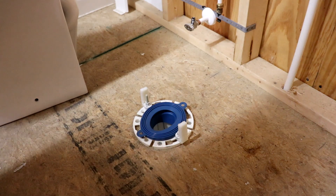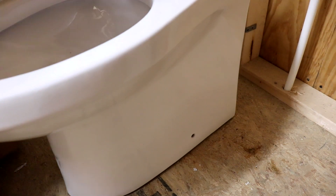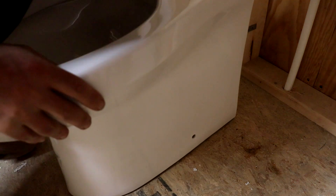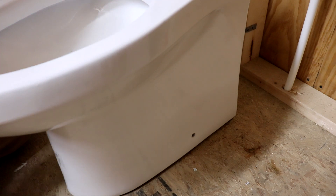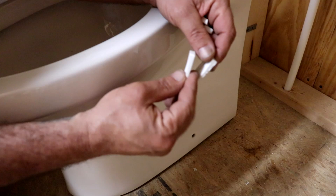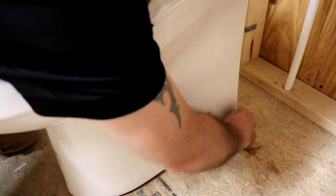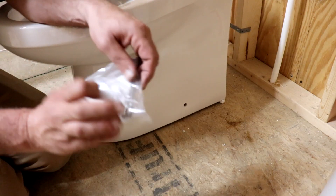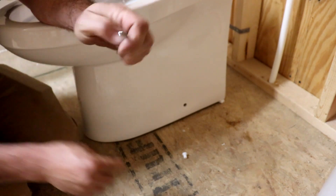Let's see about getting the toilet on here. There's our first problem — there is no way it's going to go down all the way on there. Normally we shim these things at the back. You've got your little toilet shims — they come together and you can rip them apart so you get two out of each one. I would normally recommend shimming your toilets from behind, but I don't really know how well this is going to work.